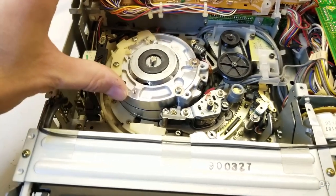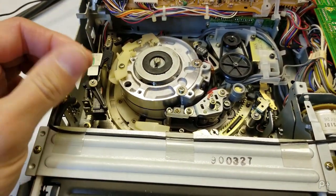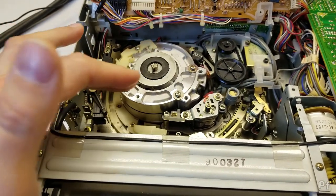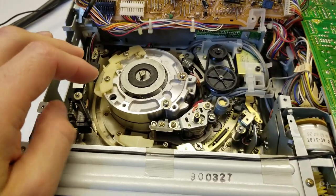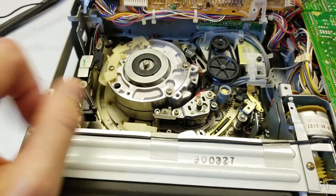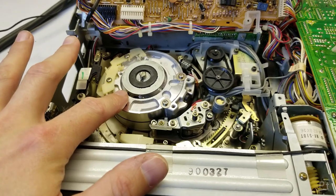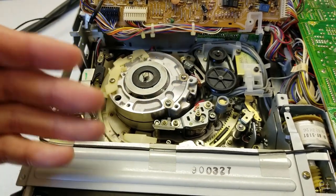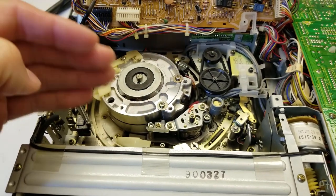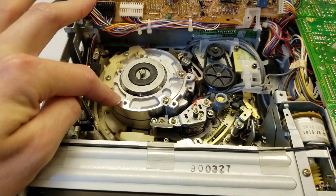The material used for the upper head drum would get polished by the aluminum oxide from the tape, resulting in a very flat, smooth, sticky surface that the tape would stick to. Originally the solution was just to buy a new upper head drum, but it was such a prominent issue that some people — I think it was Sony or 12 Volt Vids who explained it — found you could use an abrasive household cleaner to polish the upper head drum and bring it back to a proper texture.